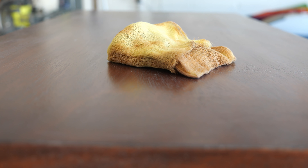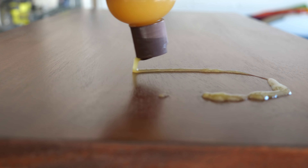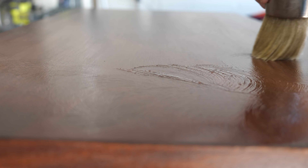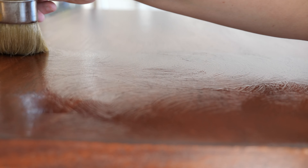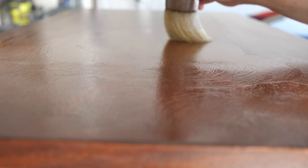To figure out the length of the aprons I used the cut legs and positioned them until they looked right without interfering with other areas on the bottom. I then measured between all four spaces to confirm the measurements on the left, right, front, and back were all the same. Once everything was cut I set everything up to see how it looked together and decided I wanted the front board to have an arch.